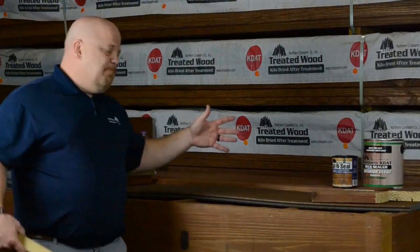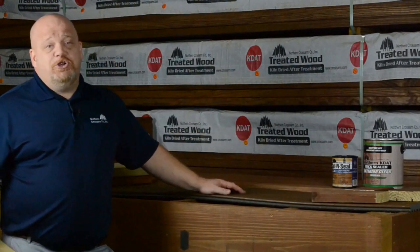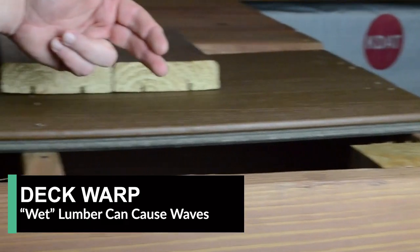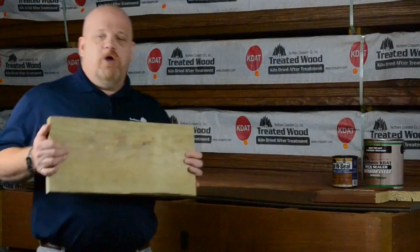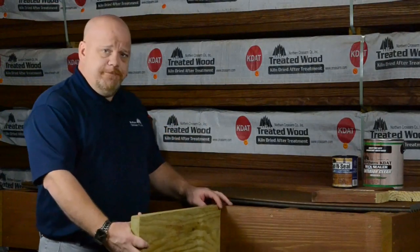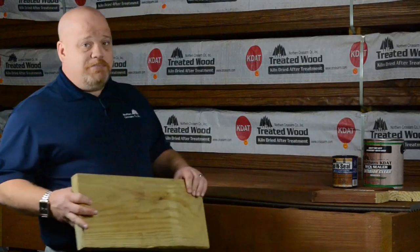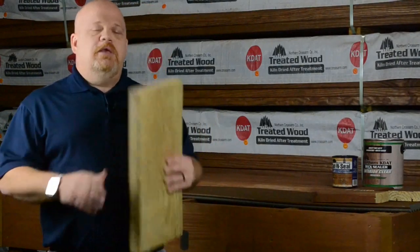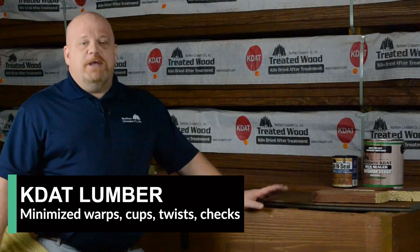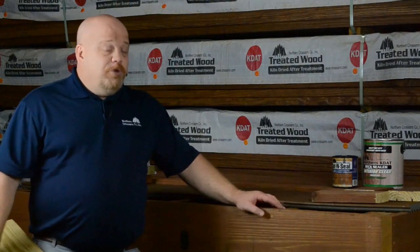If you look at composite decking, it's one of the biggest issues with composite decks — it's that wave in the deck board. What causes that? It's when that joist shrinks, moves from the water coming out of it over time. If you put down a wet joist and butt it up nice and tight, and come back in three, six months, you have no idea where that joist is going to be. If you take a kiln dried joist and put it down, do that same thing, come back in three to six months — it's wood, I'm not going to ever make a guarantee with lumber, but I'm pretty darn sure it's going to be pretty close to where it was when we left it.